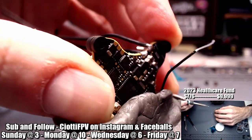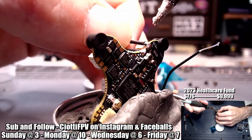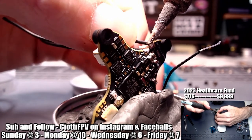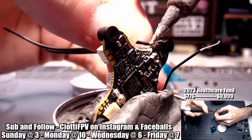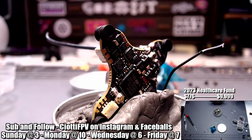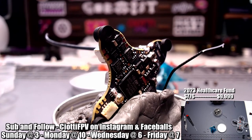All right, so my situation where the work is moving around, which is not great, so we want to push it down into the putty a little bit. Make sure that I'm getting the flat part of the tip of the soldering iron here under the, and now all of the flux is gone from the wire, so this is going to be annoying, but I'm just gonna mash through it like an idiot instead of doing it right. No, I'm not. All right, I need to get some actual solder on the tip of this wire here. Hold on, I need to re-tin it. When I cut the wire down, I cut all of the tinned part off of it.